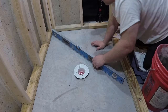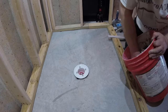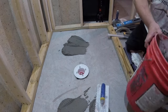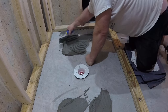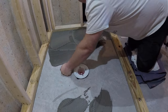In another video, I'll show you how to install the shower drain, and today we're going to build the pre-slope around it. This is a typical pre-slope that I usually build on a concrete or a plywood subfloor. To bond the concrete with the mortar, I use a thin layer of modified thinset. This prevents concrete from absorbing water, and it creates a very strong bond between the slab floor and the mortar pre-slope, especially around the drain where it gets pretty thin.